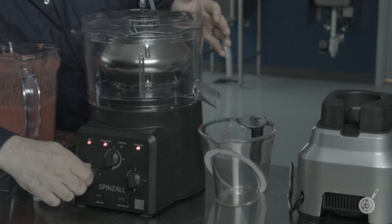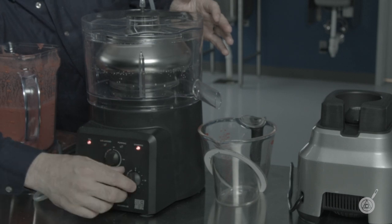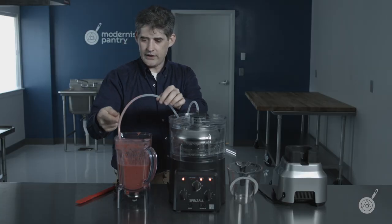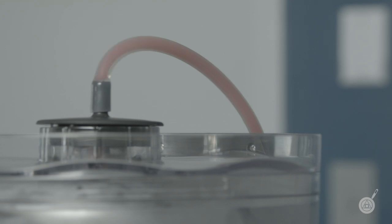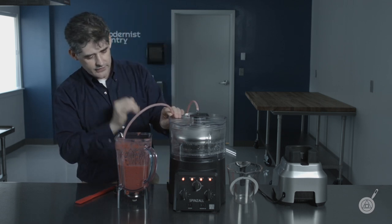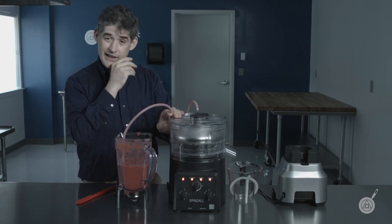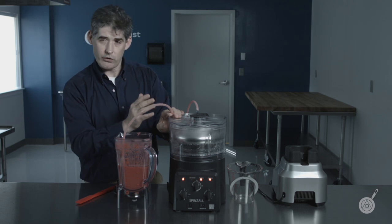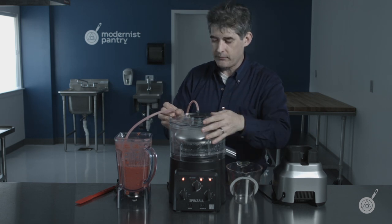Start your rotor. Because I'm going to fill the rotor as quickly as possible, I'm turning the pump speed knob up as fast as it can go — I'm just trying to fill the rotor. Put the tube into your product and it immediately starts pumping the strawberry puree up and into the rotor. You want to leave it going as fast as it can for about three to four minutes to fill the rotor almost all the way, then put it on slow so you're not pushing too much product through and making it cloudy.